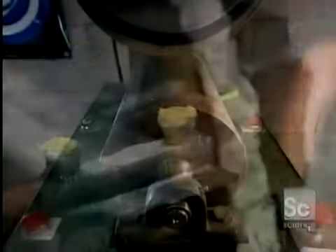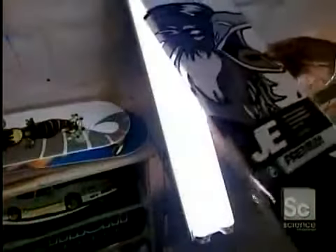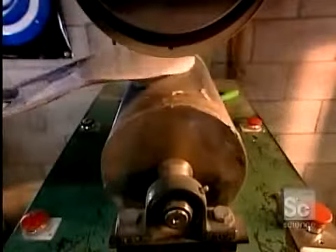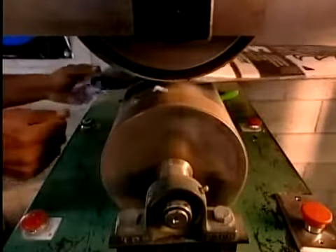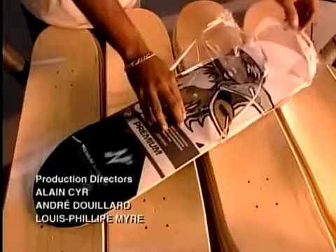The lacquer also takes two hours to dry. The final step of the finishing process is applying the decoration. The bold graphic designs are printed on plastic sheets — the skateboard factory either buys them ready-made or produces them in-house using its own silkscreen printing equipment. Workers center the design sheet, then feed the deck through a machine that applies heat and slight pressure simultaneously. The heat — 390 degrees Fahrenheit — induces a chemical reaction that melts the ink and lacquer. When the plastic comes off, the deck is finished.